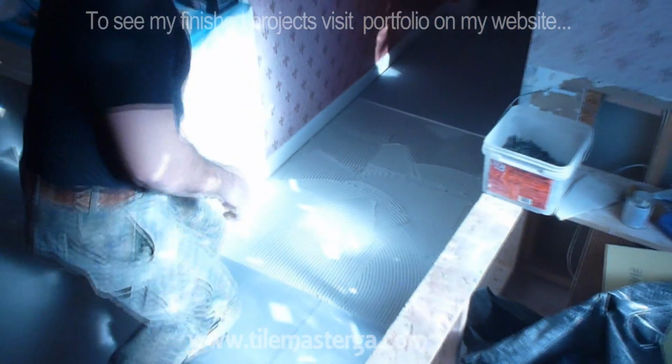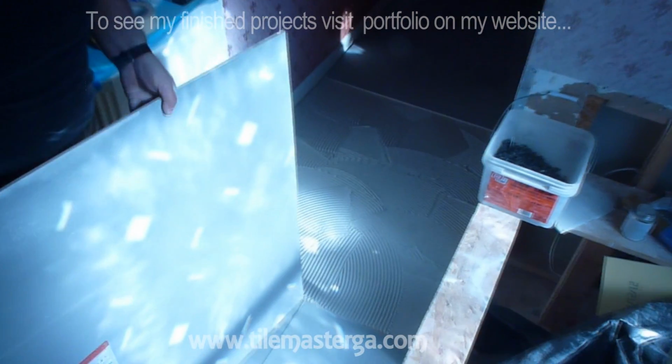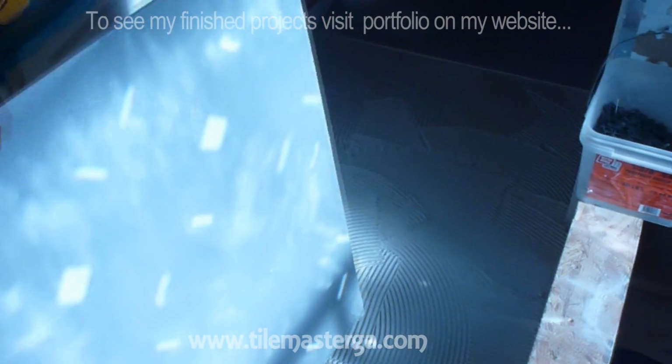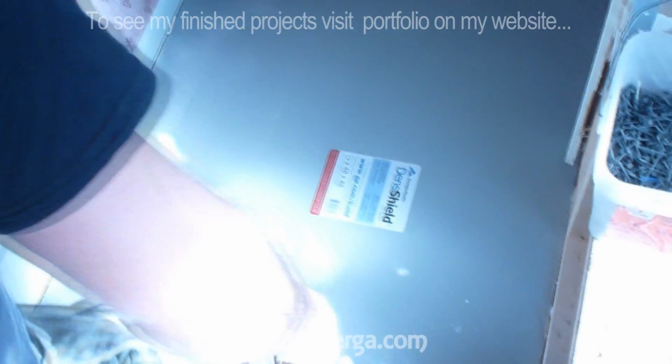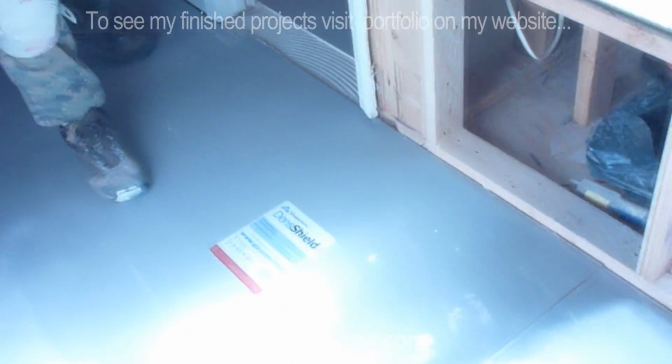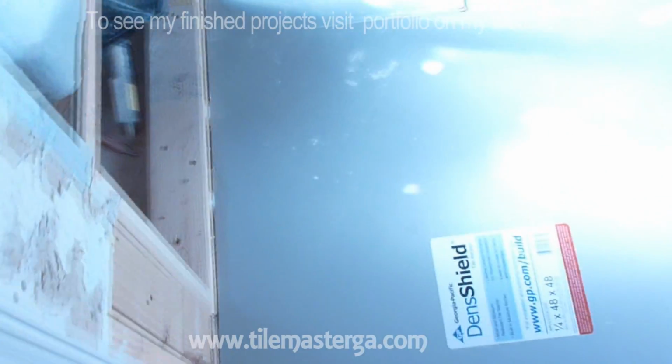Okay, so Peter is moving on with the installation of the floor. We're using a 1/4-inch notch trowel to apply thin set, and he's putting piece after piece the way he was measuring and have everything laid and planned. Those pieces don't have to go under the baseboards. They have to go close enough piece to piece and to the trims, to the sides. Another thing, once we have the board in place, it's good to walk over it to make sure all the setting compound is squeezed and the board is pushed all the way to ensure good bonding.